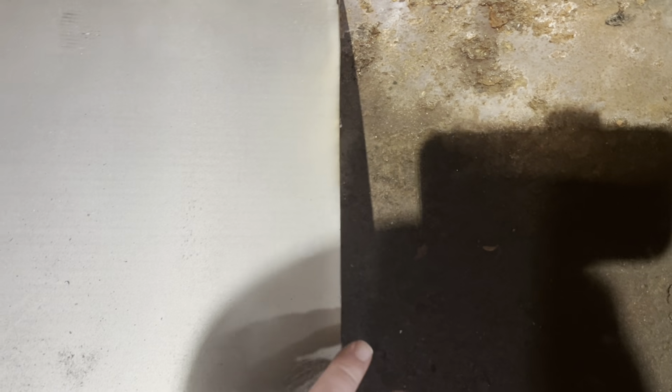This should be about 18 inches from here to there. I might move it back a little bit more. Maybe it's about 19 inches. That way I could get an 18-inch log in here. So yeah, what I'm going to be doing is in the front here, where it's open, I'm going to cover that. I got to figure out how I'm going to get this to curve, maybe get a piece of cardboard and just try to make a template and then weld that piece on there.